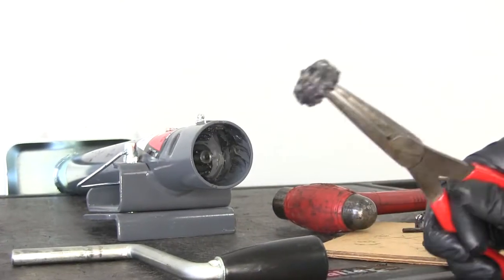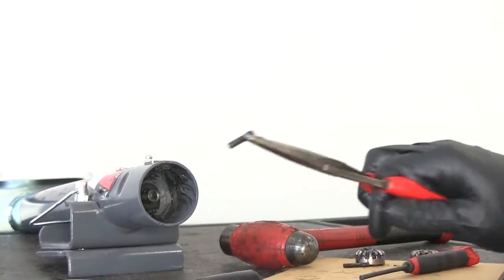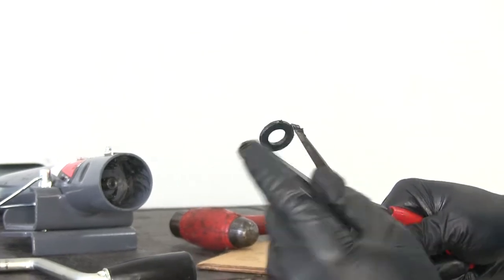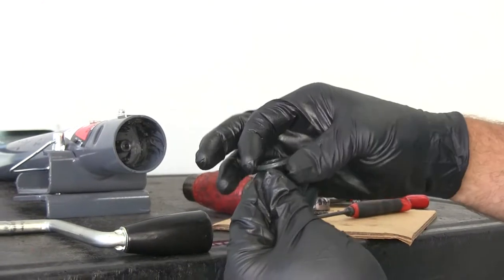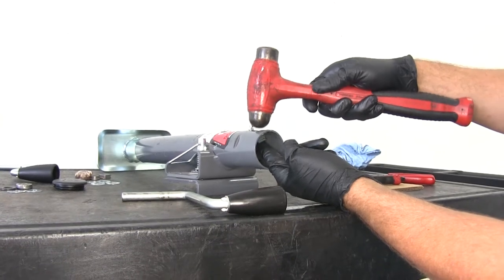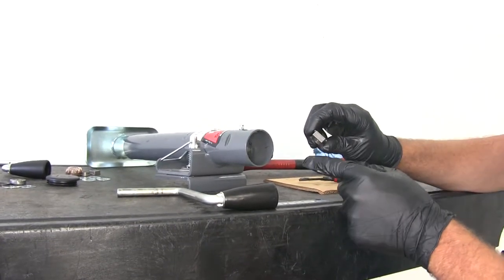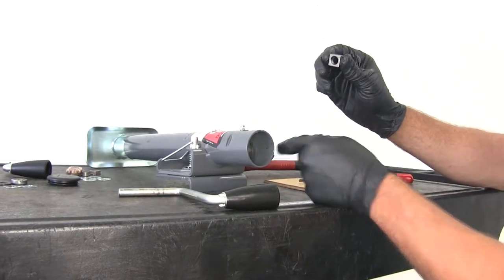The base gear is just going to slide off, and there's also a floating pin that goes through that middle section which is the screw — we can take that out. Right below it is that thicker black washer, which is going to act as a support washer for our gear inside. Then we can just tap out that square portion — that's the flanged bushing — it's going to fit right over in the square hole, and it gives our handle a much wider area to ride on so it's not riding on just the thin tube of the jack.